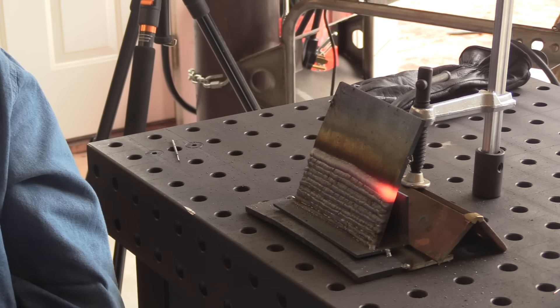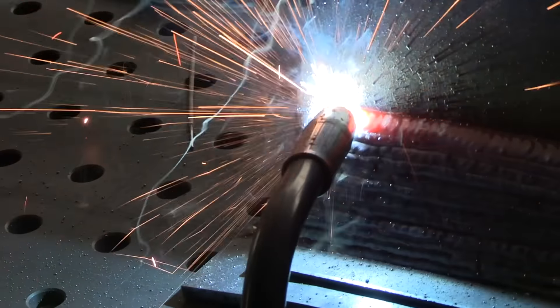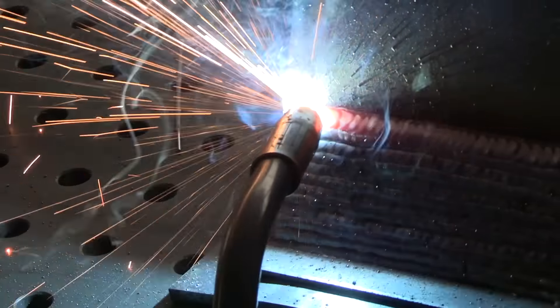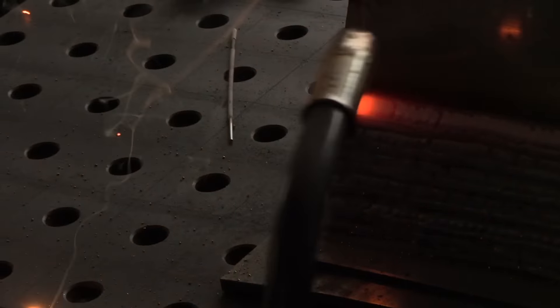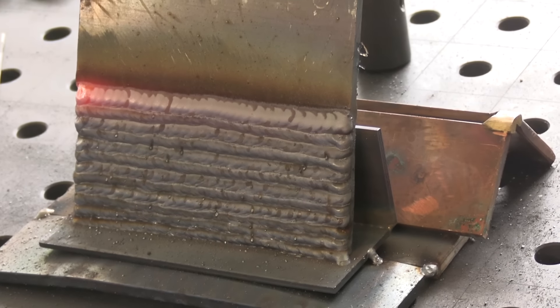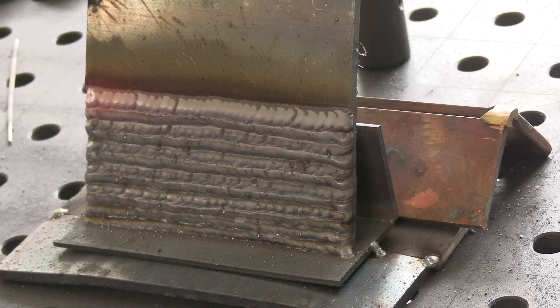Short circuit MIG has lots of limitations. There are a lot of people out there that don't seem to recognize the limitations and will use it where it shouldn't be used. One of the main limitations is welding downhill vertical over hot rolled mill scale — don't do it. Clean the metal to clean bright metal, and don't use a 115 volt MIG welder anywhere where if the weld breaks, somebody will get hurt. But we're talking about practice here, not critical welds, and for practice, if a 115 volt MIG welder is all you've got in your garage and you want to practice and get better, you can do it.